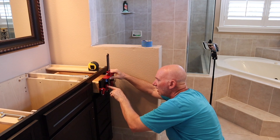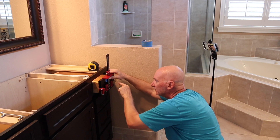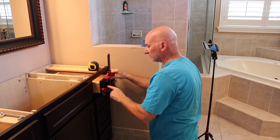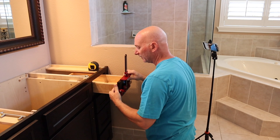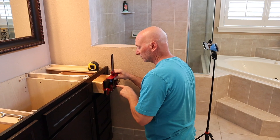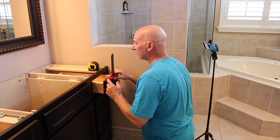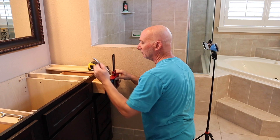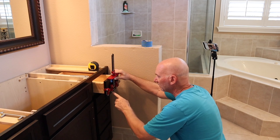This drawer face is 10 inches wide and five and a quarter inches high. Half of 10 inches is five inches — I set the jig from the center line to the stop at five inches on center. Five and a quarter divided by two is two and five-eighths, so from the center line two and five-eighths up to the stop is where the center line of the face is. The dimension remains three and three-quarters for the drawer pull, so now I put the jig on here.